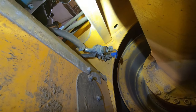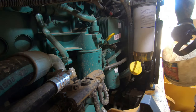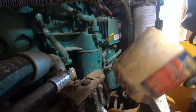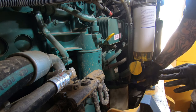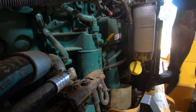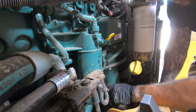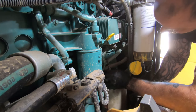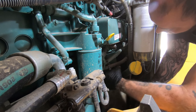Once you're done draining, take that hose off and put the cap back on. These filters tend to get a little messy coming out, so I use a washer fluid jug with the top cut off to catch drips. Pay attention to how the filters come off — this one comes in at an angle, so you have to keep that in mind when putting them back on or you might cross-thread it.